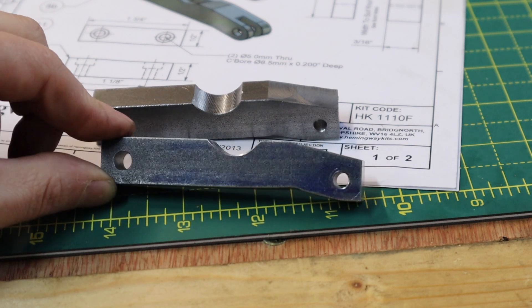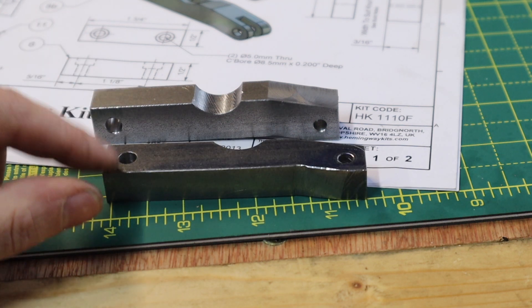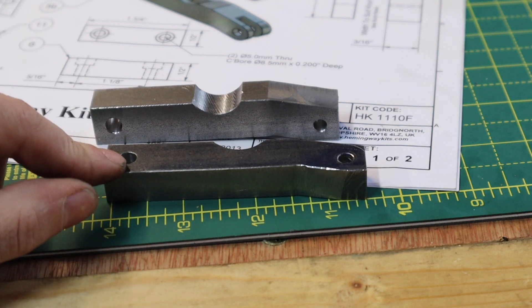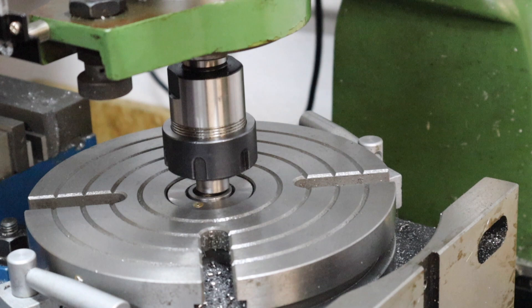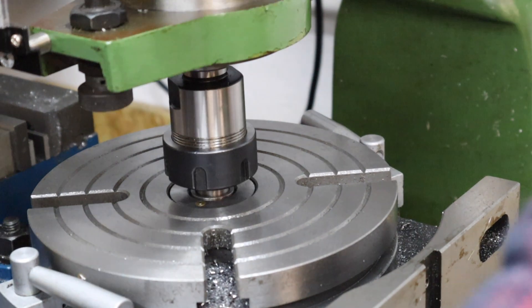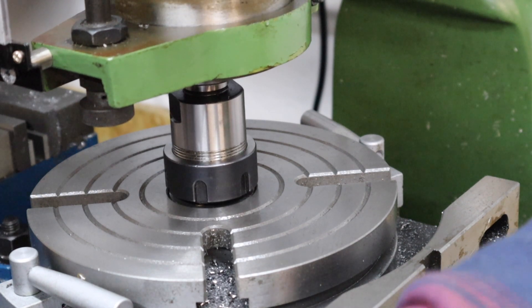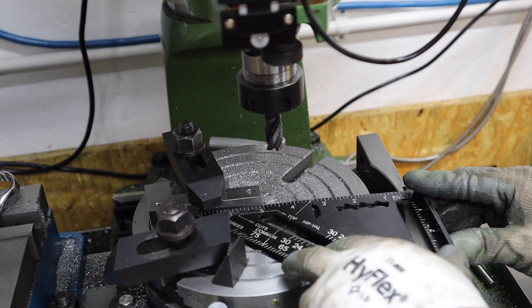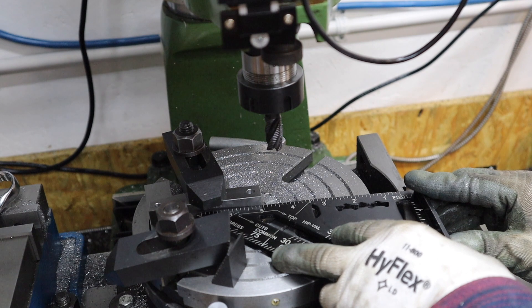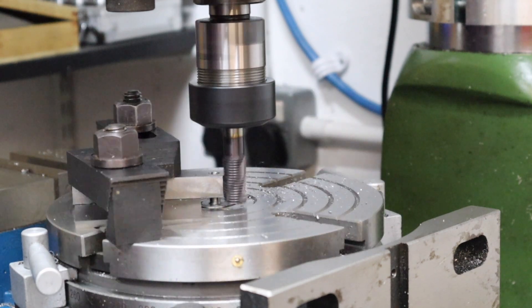I'm heading back over to the milling machine on the rotary table, using the fixture I made in a previous video. Starting with the quarter inch holes to do the radii on that side, then moving over to the other holes. What I enjoy about using this fixture is how simple and quick it is to set up - with the insert in the collet you just locate it centrally into the Morse taper attachment, then with a square on the back of the turntable make sure the workpiece is running perpendicular, and from there it's just a case of machining out those curved features.